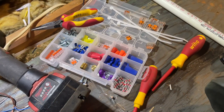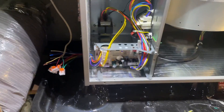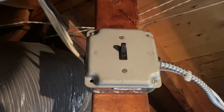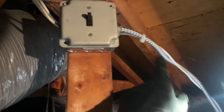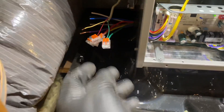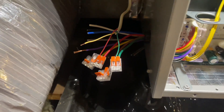It's 9:45. Let me show you what we got done. If you see the electric out, you know what's done already. There's my switch — single pole, double throw switch. I ran some BX and I've got two Wagos right there for my line voltage. Two lines of 110 volts each. I've got my fan right here — power is power, and it is fan.